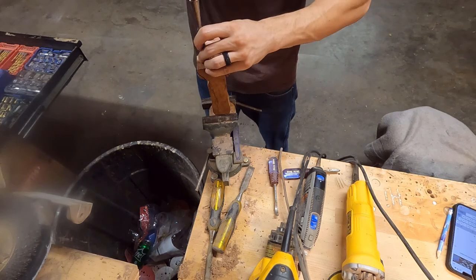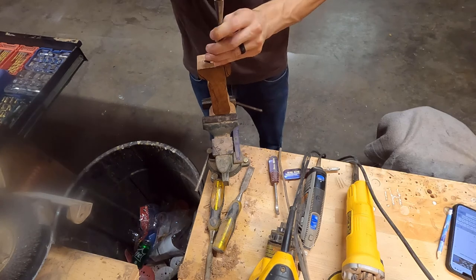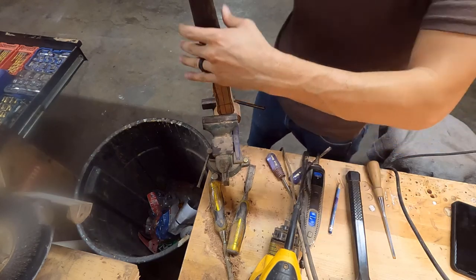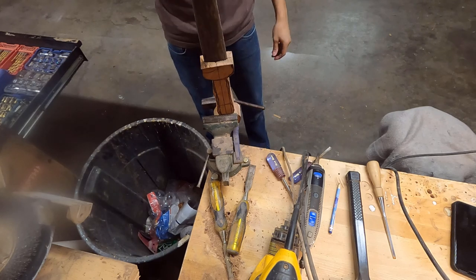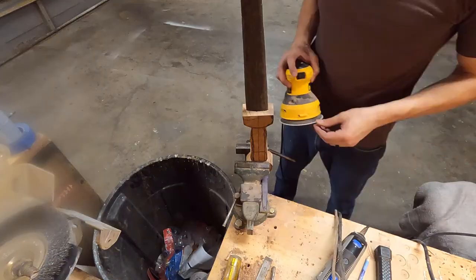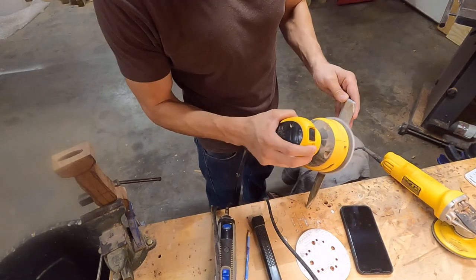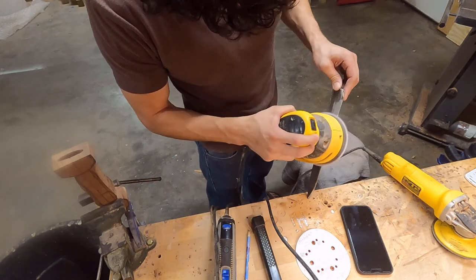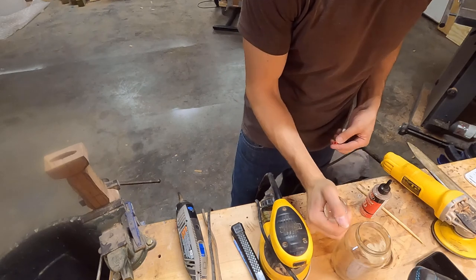The process I'm using here is drilling out a whole bunch of holes pretty much to depth, then taking my chisel and cleaning it up, then doing a ton of back and forth checking how it looks with the swordfish bill and on the wood. I spent probably a good two hours doing that because I wanted it to be nice and tight, so I went really slow. I did leave a little bit of room, and that ended up working out perfectly — because when I go to set the bill, I can make sure it's straight along with the handle material, which reduces the amount of corrective shaping I have to do.